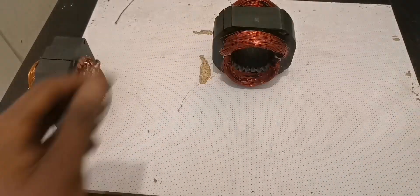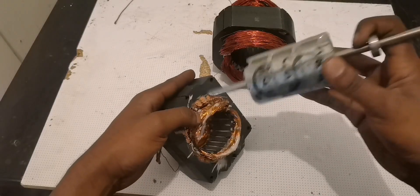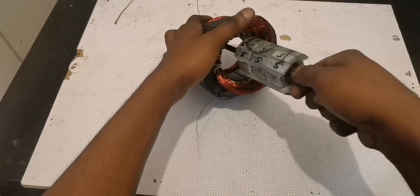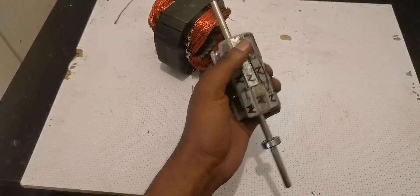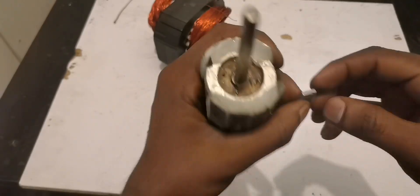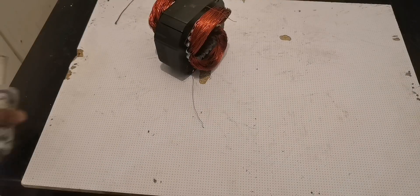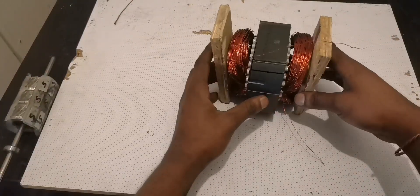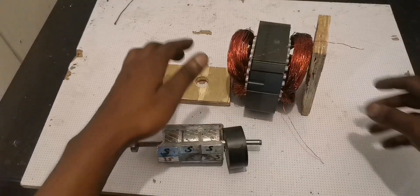Now let's start arranging. Before we get there — we are going to use the same rotor we were using before, which has two poles: south and north. The magnets we are using are the same ones — 35 millimeters by 10 millimeters and 3 millimeters thick. I'm going to pause the video; when I come back the rotor will be in place and I'll cover the magnets with tape.